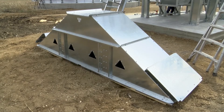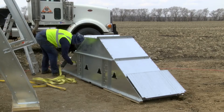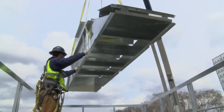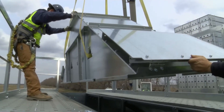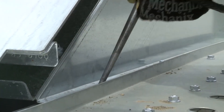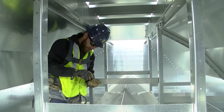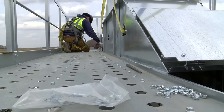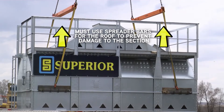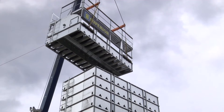If the roof has the gravity fill option, you need to install the gravity fill to the roof before swinging the roof section. Slide straps through the ducts to cradle the gravity fill and lift it onto the roof section. Remove any shipping boards that may be installed on the gravity fill. Slowly lower the gravity fill onto the roof and guide it into place with punches. Once the gravity fill is set down and the holes are aligned, have one person go inside with the serrated flange nuts and another person pushing bolts through from the top side. Once the gravity fill is secured, attach spreader bars and the lifting brackets and attach the lifting brackets to the roof. Swing the roof just like the previous sections, paying attention to the orientation of the ladder to match the previous sections.